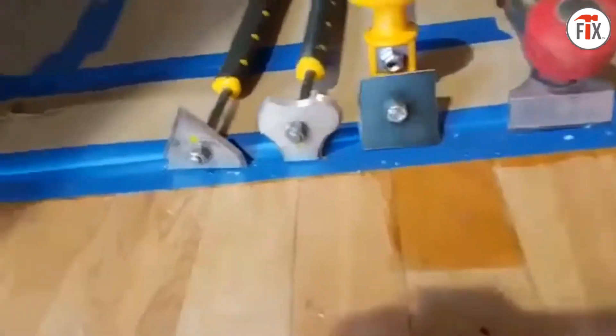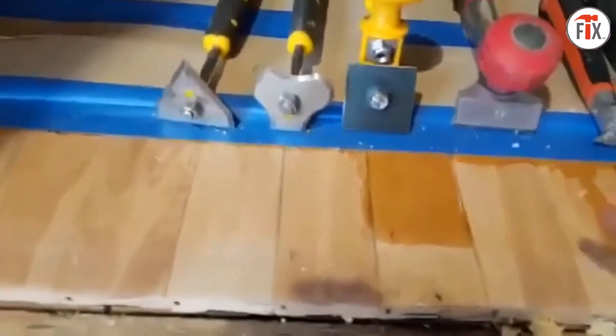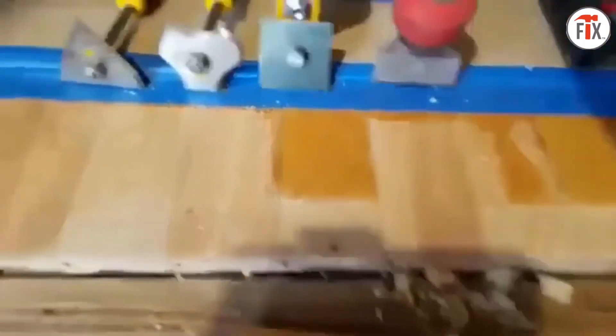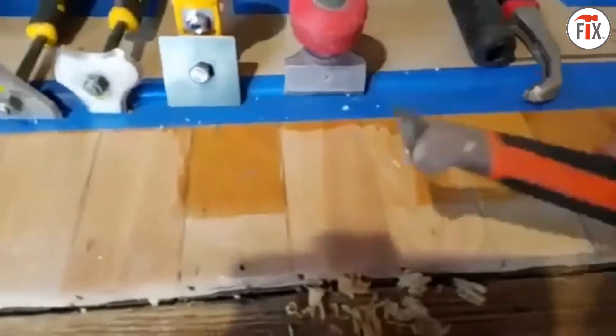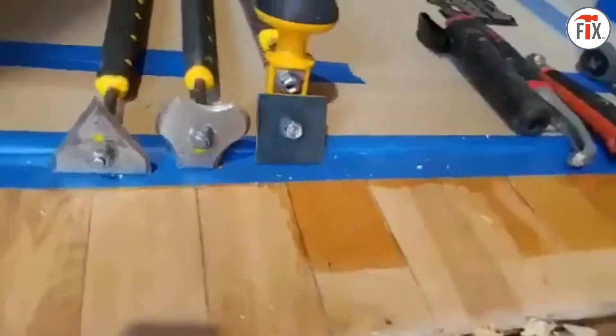In a nutshell: the wide scrapers are really good for the speed heater, and carbide works great for dry scraping flaky paint. But on smaller applications it's hard to beat the one-inch triangle. Heat it up and hit it with your wide one first; if not, use the small one for dry scraping — it will take a little bit off with each pass.